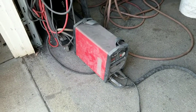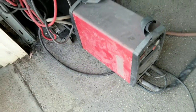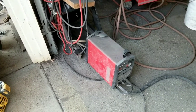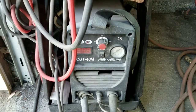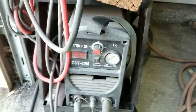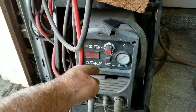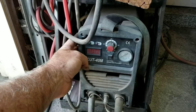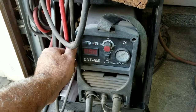These are all mostly inverter units — see how small this is? Very small. These inverter ones do the job, but one of the big other problems with these small units is they don't work very well on 110. In fact, mine doesn't work really at all on 110. So if all you have is a 110 circuit, it might not be the tool for you.